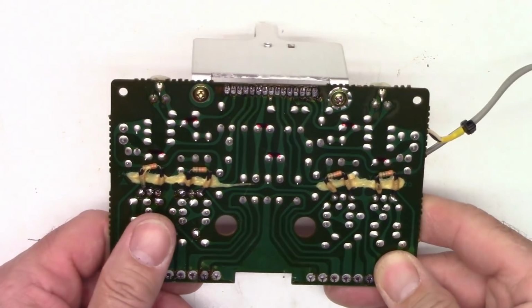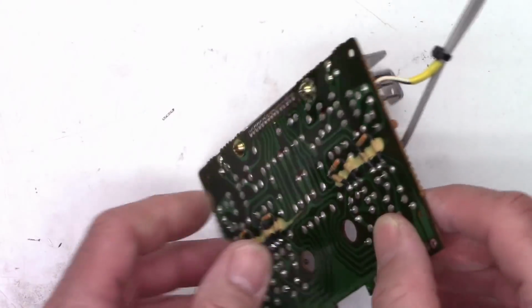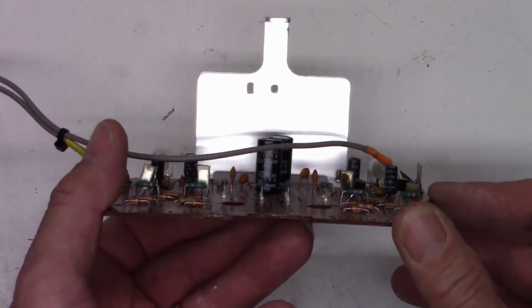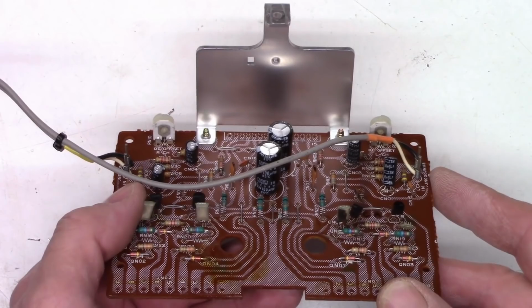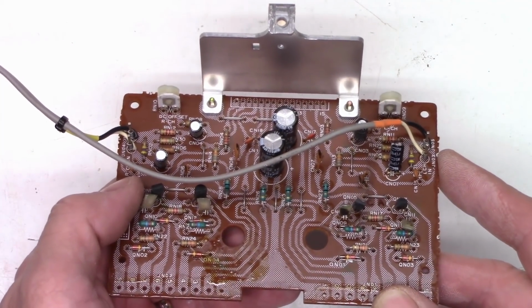Alright, so I went ahead and selected a couple of larger face with washers screws to replace the missing ones on this heatsink. So I've got it all cleaned up thanks to the Magic Solution Acetone. Next we'll go ahead and apply some heatsink compound to the back of the STK3082 and we'll put it in place.